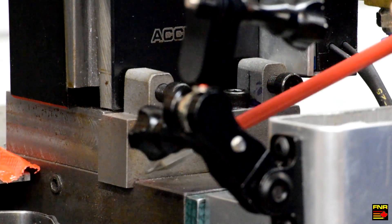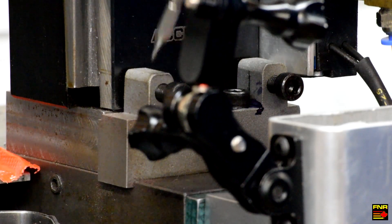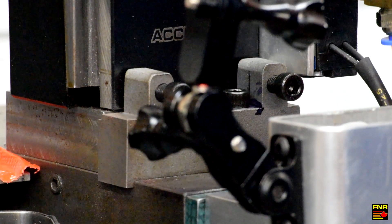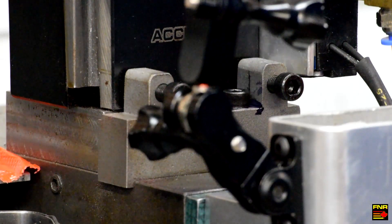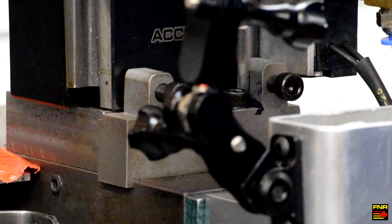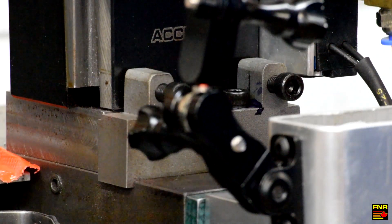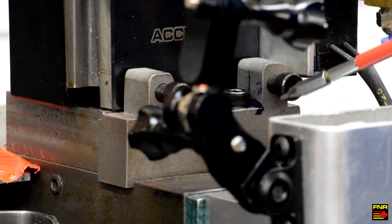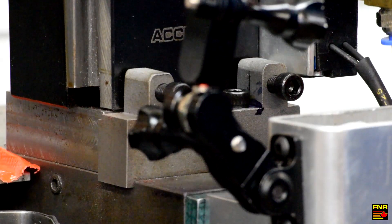This feature fits on top of the tool slide — there's a little lip that comes around the side, two ears that pop up, and a pair of bolts that press against the tool post. It's a tool post rotation stop. Normally you crank down the knob on top of the tool post and that provides enough friction to keep it from twisting under cutting forces, but that wasn't working. By firmly mounting a stop on the carriage and adding two micro-adjustment bolts, I can very accurately square up the tool post to the slide, lock it in place, and adjust its degree of twist very finely — much easier than tapping it with a hammer.